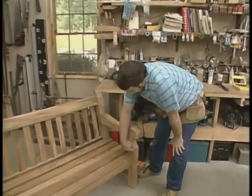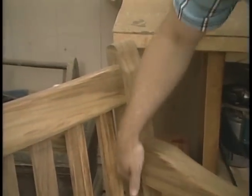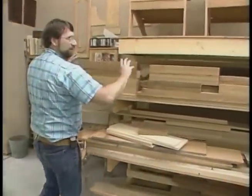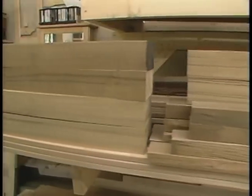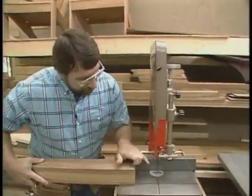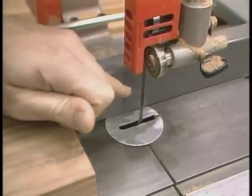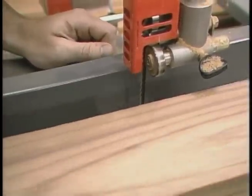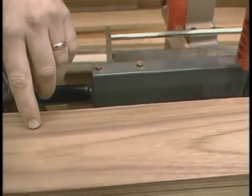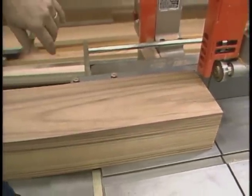Now to get started on our project, I want to cut these shaped pieces — the curves in the front leg, the armrest, the back leg, and backrest, which is angled and curved at the top. Over here on my lumber rack, I have all the teak I need to build the bench, cut approximately to the right size. This piece has been laid out for one of the front legs — it's straight and then curved up at the top. I'm going to use my bandsaw to make the cuts, set up with a quarter-inch blade. The reason I want to use a quarter-inch blade is that some of the curves are fairly tight, and the narrower the blade, the easier it is to cut curves. This particular cut runs straight for about 20 inches and then it curves, so I've set up a rip fence to cut the straight portion, and when I reach the curve, I'll slide the fence out of the way and finish the cut.